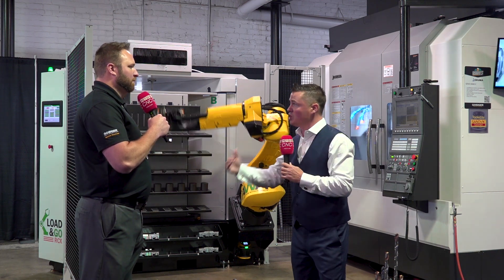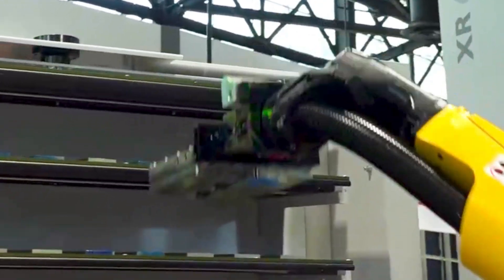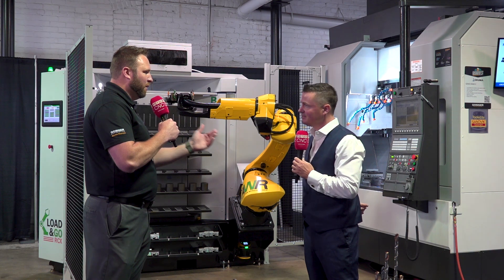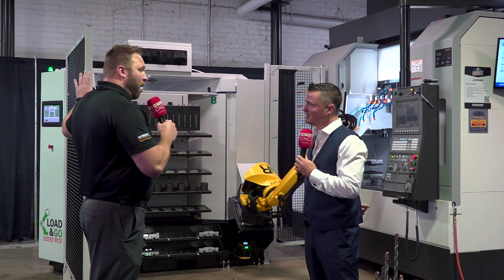It's not a universal rectangle — I can switch out any rectangle part I want. I can plug it in on the side of the machine or on my computer and say this is what I need to do next. It truly is for that high mix, low volume job shop. These units are all designed specifically for the job shop. Why would I automate a 20-piece job? Well, you'd automate it because you don't have the operator standing there — your skilled labor isn't tied up loading, unloading parts and pressing cycle start. The operator schedules that project on the HMI and the robot calls up that program after going through 10 pieces or five pieces and on to the next job, simultaneously and automatically without an operator being involved.